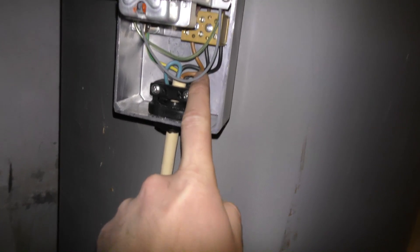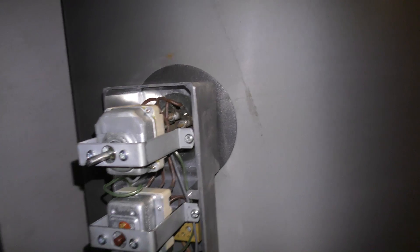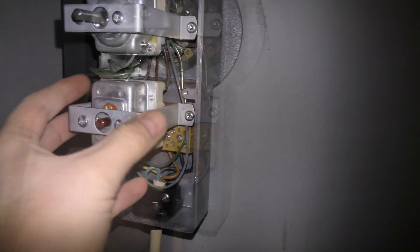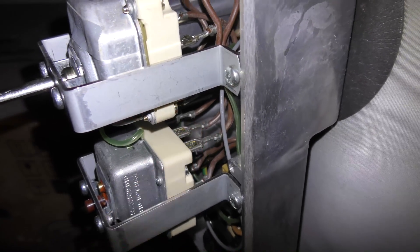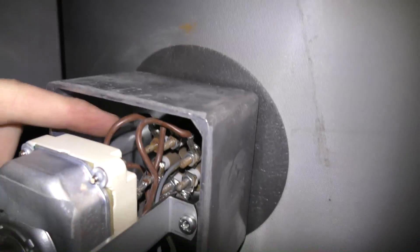There's one there, one there, and one there, and each of them are 230 volts. They are combined in a way so that together they bring the voltage up to about 380–400 volts. All three of those phases go into this box, which is kind of an emergency thermostat switch-off. There are three wires that go in and three wires that go out. This is a big switch — it can switch off all the power to the heating element. The heating element is in here, going into the tank — it's some big resistors that heat the water.